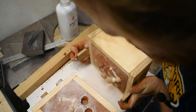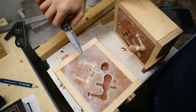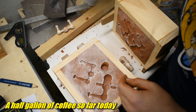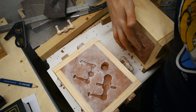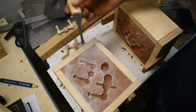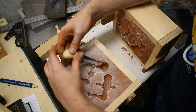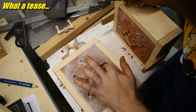Oh, it worked! I want to do a little dance because that worked. Alright, pull this out, clean up around that hole. Sand is dripping off my knife — that's hard to do when you're full of caffeine, my fingers are shaking. Also excitement, but I'd be a lie to say I'm this excited that I can't hold my hand still — I am, however, this caffeinated. That just fell out along with some sand, which just means I'll have a little bit more metal on the edges. But I can fix that with the grinder. And since I'm all about woodworking sacrilege, today I'm going to cut my gates with this very nice sharp chisel. Sacrilege because using it on sand will probably ruin the edge. This is one of my pattern making chisels — I make some of the patterns in wood.